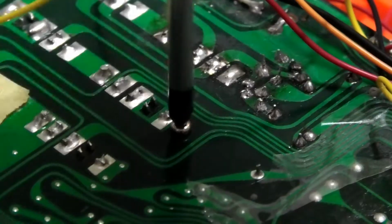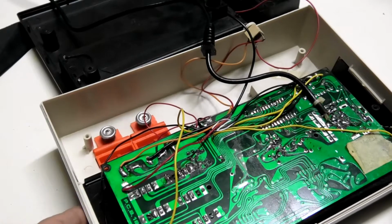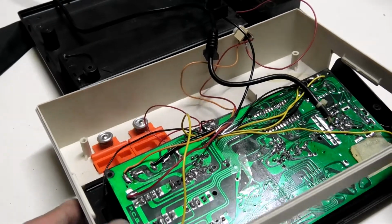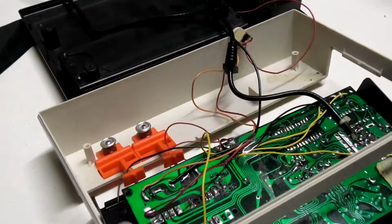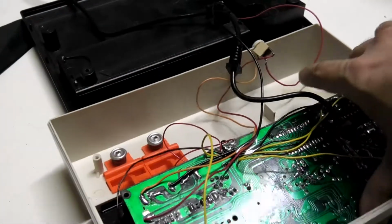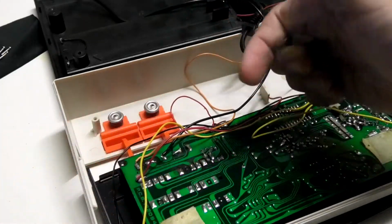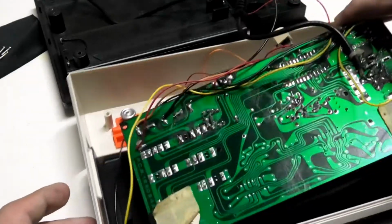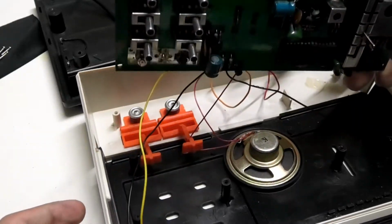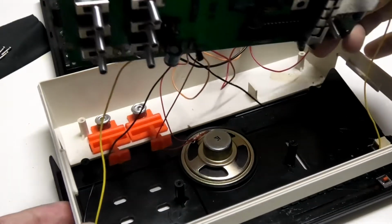There are 4 more screws on the board to be taken out before we can remove that, but again, wires attach it to the case. The case itself is in 3 parts, the bottom half with the battery compartment and the top half, which itself is 2 halves. All of which are attached with wires, of course, that are weakly soldered on so they can come off really easily if you're not careful. The speaker wires also kind of just hang around, dangling about, so watch out for those as well.